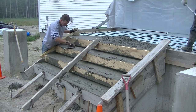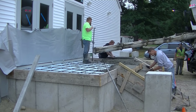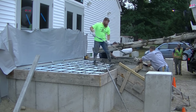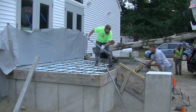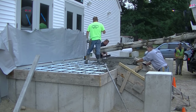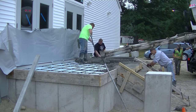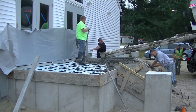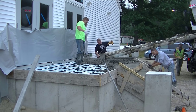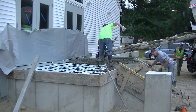Pushing the rebar in means digging out just a little extra concrete here and there, but it wasn't too bad. Darren and Luke are already getting started pouring the entryway up top. That's basically how we pour a set of concrete steps. If your slump is good it makes the whole process easier — get them poured, get them vibrated, and if you did a good job forming them, getting them magged out is fairly easy. Then it's just a matter of waiting for them to set up a bit before finishing.